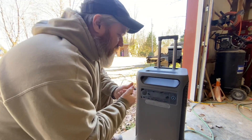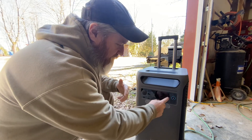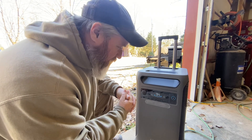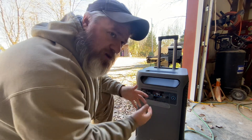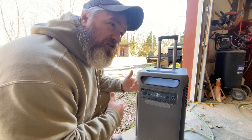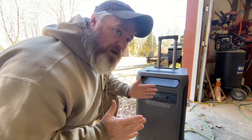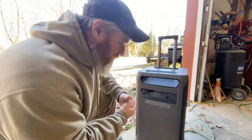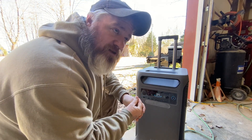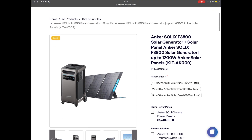About an hour and a half later — the sun has moved just a little so it's getting a bit less sun. We went from 90% up to 94% — that's four percent in an hour and a half. The panels are only pulling 55 to 56 watts right now because I'm losing some sun behind the shop. If I really needed to charge it I'd move the panels and track the sun better. But in an hour and a half we went up four percent with a limited amount of sun and just 400 watts of panel — that's pretty good.